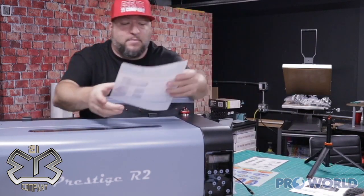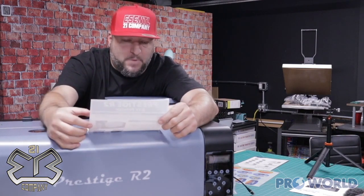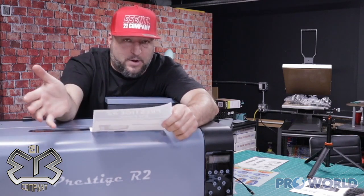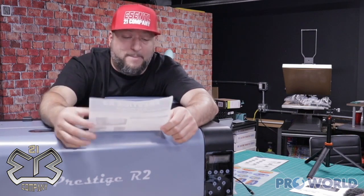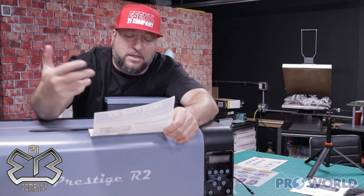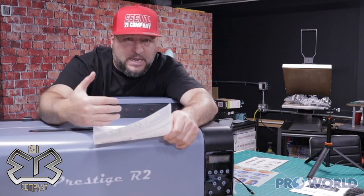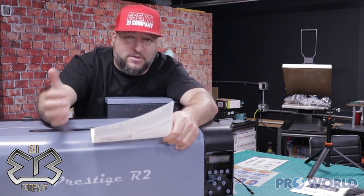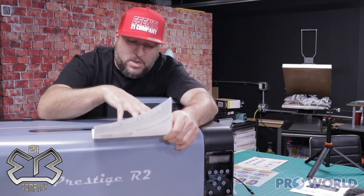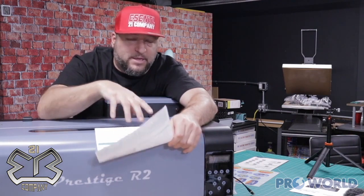Now let me just break down quickly some of the features that it has. That way you just know right off the bat just watching this video. So we've got 27 square feet per hour. That's anywhere from 150 to 200 pieces per day at 12 by 14 size. We've got a white ink management system, like we saw with the stirring unit. We've got passive auto cleaning, so it maintains the cleaning of the printhead every 4 hours when not in use and left on. It's got active auto cleaning, so it performs cleanings in set intervals while it's actually operating, which is a good thing. It's got a head strike sensor that's built into the system, and an automatic film sensor to make sure that it doesn't print when you run out of film, so that's a good thing.